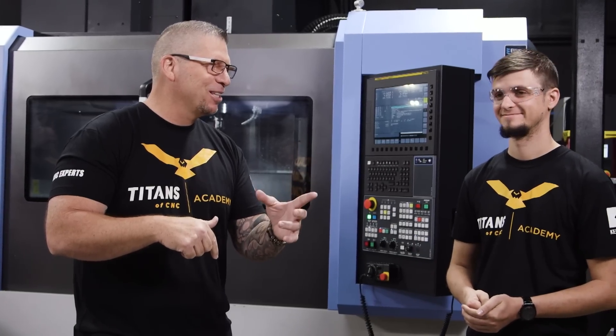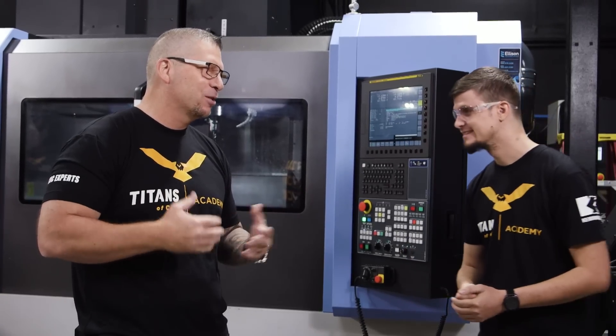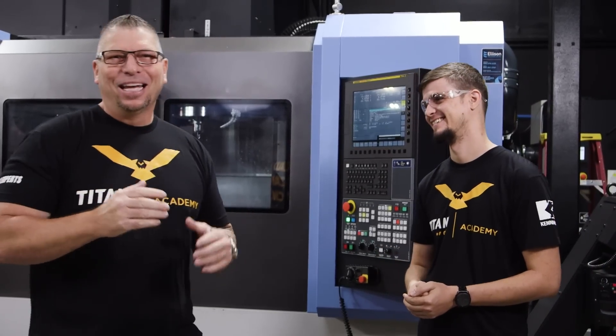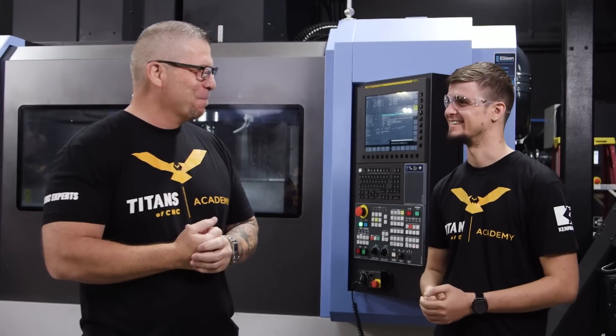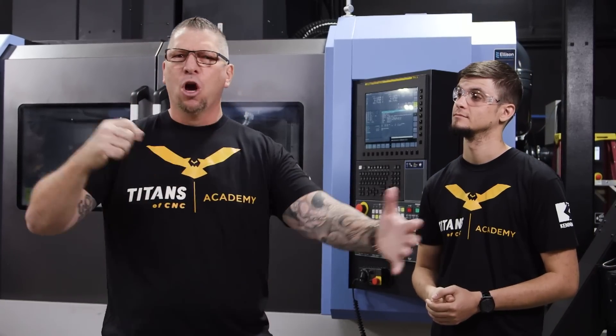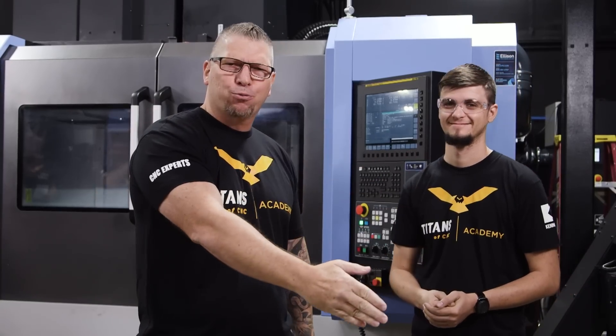What did I tell you when I came in this morning? We were at one and a half times D, but I said no guts, no glory — let's drop that thing all the way down. What did you tell me? 'We'll see.' He thinks it's going to break. But I'm like, let's have some fun. So one and a half times D, then it's going two times D — taking the entire flute right through steel. Not slowing down. Just bah — right through.